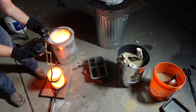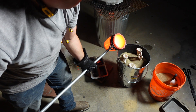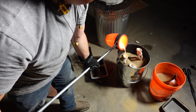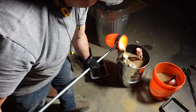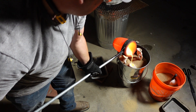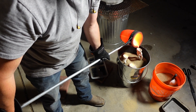I'm just packing sand around them to hold them upright so that we can cast the metal without them tipping over. Pull our bronze out of the foundry or the furnace. I made a big mistake here — you won't see it in this video, but I poured a little cool. I think it actually was a benefit on the buffalo skull as it is a solid cast and the shrinkage actually happened inside the crucible before I started pouring, or at least some of the shrinkage. It worked out really well for the buffalo skull. The other two pieces didn't quite cast out all the way, but that's alright.